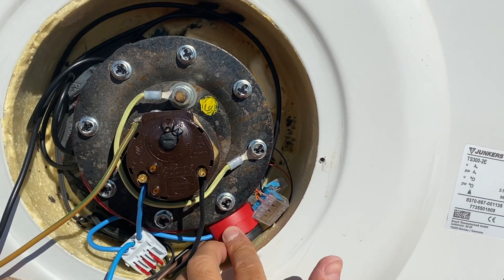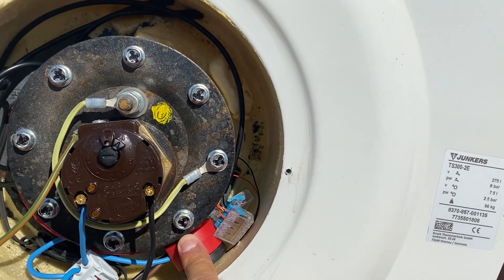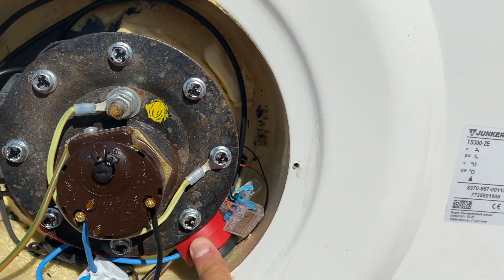Another part of my experiment is that I had the Sonoff downstairs at the circuit breaker, but here I'm using the Shelly 1pm directly on the water heater on the rooftop, where there's more than enough space for a few Shelly 1pm units as you can see from the images. Since it's August and very hot here, I'm also testing whether it can handle the heat. In a few weeks I'll be able to report on that — right now it's working great, measuring temperature and power consumption.